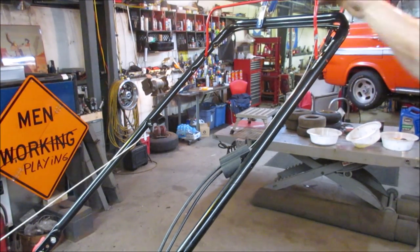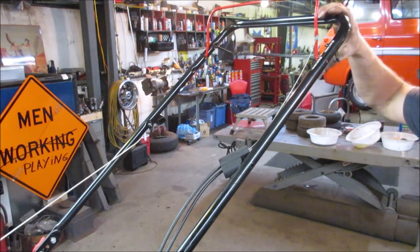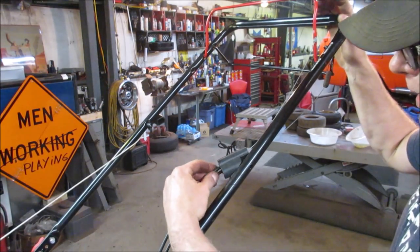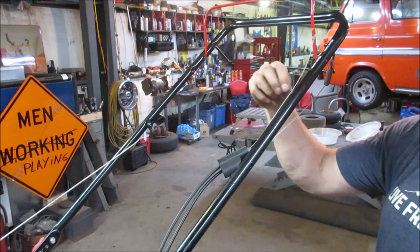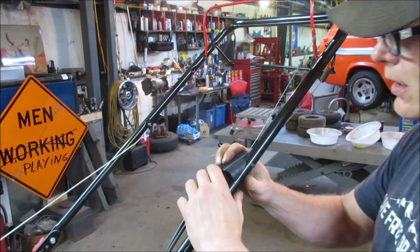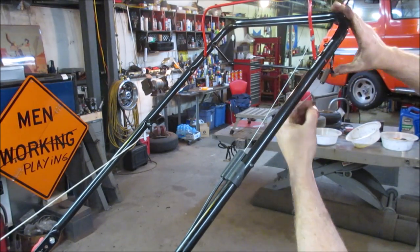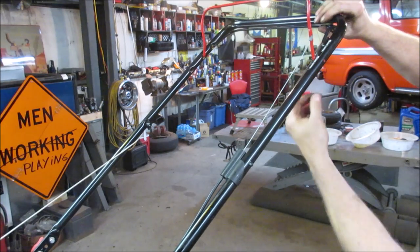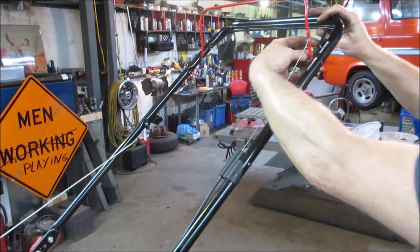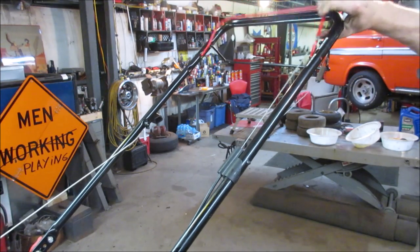One thing we should probably address — we talked about that lever up top. This is the one that makes the wheels go, and this is the one that makes the engine go — the dead man: you let go of it, it dies. But this bracket is flapping and you can see how much slop is in these cables because it's popped out of whack. Let's get that back into place. Now you can see the cables are taut — this one's almost taut but the spring up here is extending, which means that belt has full tension below. That spring is stretched out so that's full tension on that belt down there.